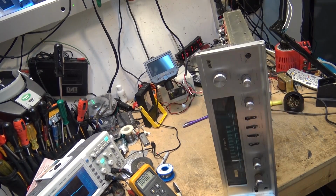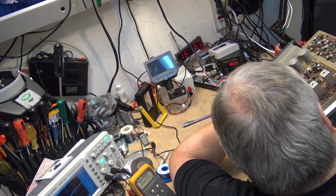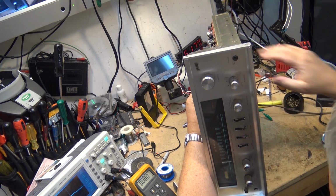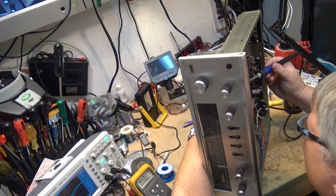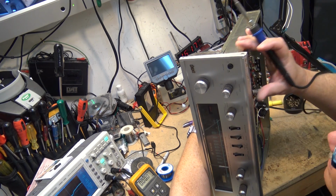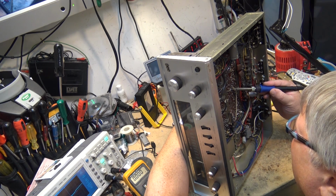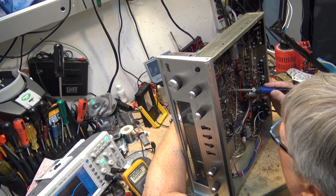That'll be close enough. So once again, I'll put the component in on the positive lead in here, like there. And I'm going to just heat up the board a bit so I get the first lead through. Now the first lead's through, and I've twisted it a bit so it hasn't stuck to the board. Now I heat up the other side, and I can push the component all the way down.